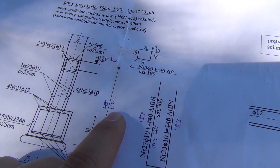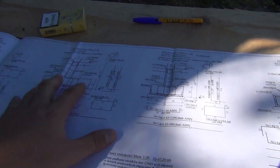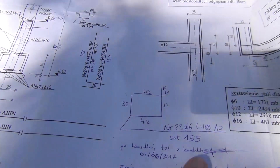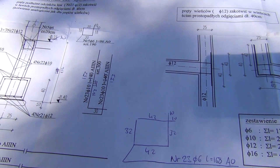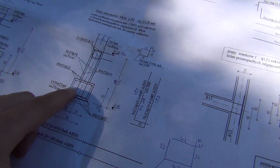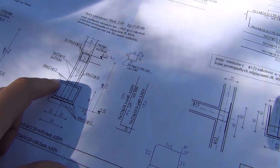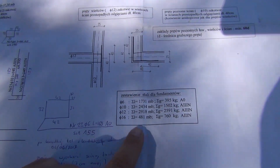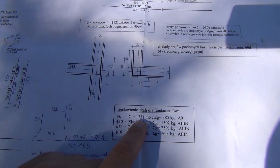Automatically all related measurements have to change by seven centimeters. The constructor also forgot to draw one piece inside the project — the part that holds together the rebar, the same as the others — and because of that, a few meters of steel were missing from the foundation summary. Mr. Pavel suggested ordering more, but what was ordered didn't cover it because there are about 155 pieces. So I took Patrick to the supply yard and we brought back 30 lengths of 6-meter, 6-millimeter diameter steel wire.